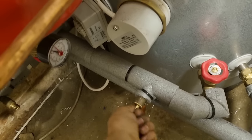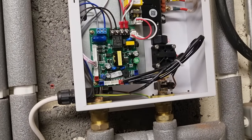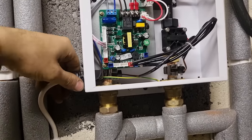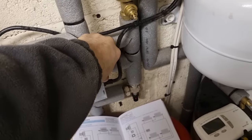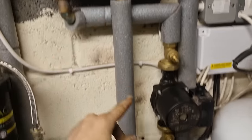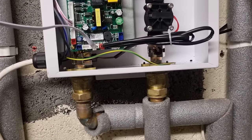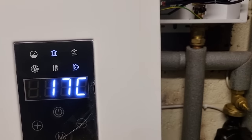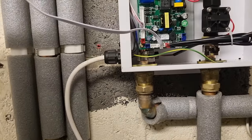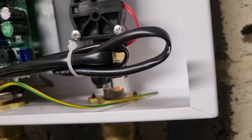We'll just get it drained back down again. I'll empty the boiler - I've got the pump valve off, I've got the filter off, so it won't actually empty the system too much. Basically what it's doing is it's not putting power onto the pump. It shows it on the flow in the instructions, but the pressure switch - got to be careful because that's all live in there. The pressure switch is on the return - see it clicks on, pump starts. But it's obviously not proving the pressure switch so it's not moving across, or it's the flow switch. It runs and then just goes off - you can hear the relay click on the board.